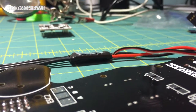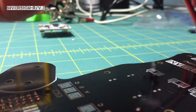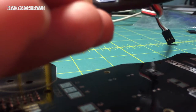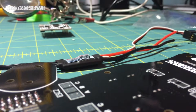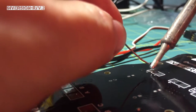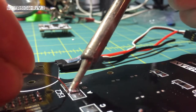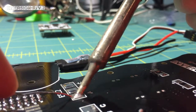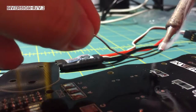Okay, so I already fluxed those pads. I want to take this sticker off and flip it over onto this side — this is the BEC side. We did that to keep the BEC off so it gets some airflow. Positive side is on that side, and then the ground is on this side. What I would suggest is lining this up, but actually go ahead and tin up the board first — that'll just make your life easier. Get a nice little gob on there, same with the back. I don't think it's going to be tall enough to cover the wire like I like it, but that front should be alright.